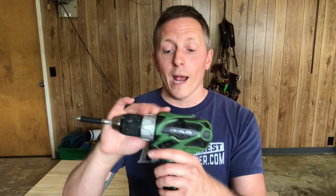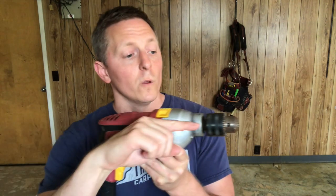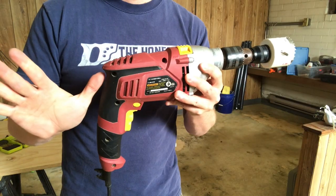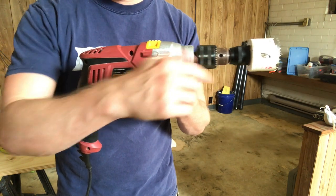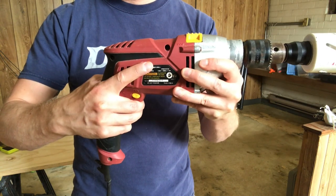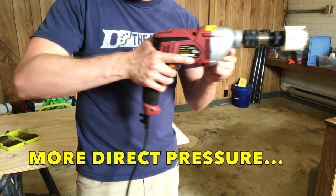This would seem like an all-around winner, but it has its setbacks too. While mid handle drills have more control, they're also less powerful — or it might be more accurate to say that they don't direct their power as well as a pistol grip does. In order to get maximum drilling force, you want to deliver pressure straight through the tool into the tool bit. The handle of the pistol grip lets you do just that. It gets your palm much higher on the tool, putting your wrist and your forearm in direct line with the bit. Now you can push forward with more direct force while drilling. You even have the option of raising your index finger higher on the tool and squeezing the trigger with your middle finger, providing even more direct pressure from your palm on the back.